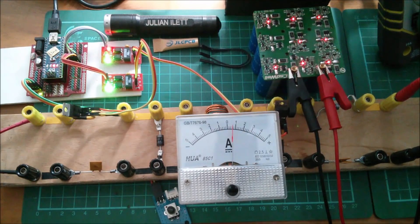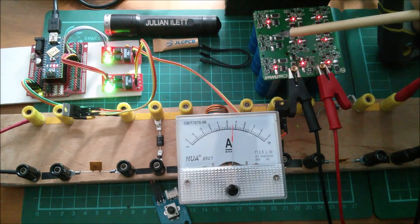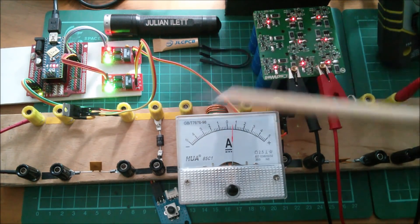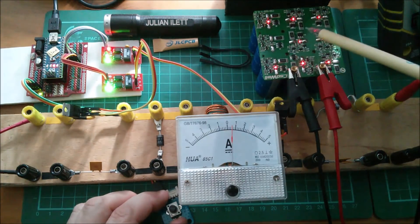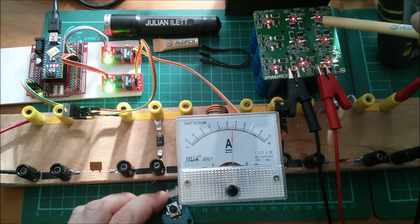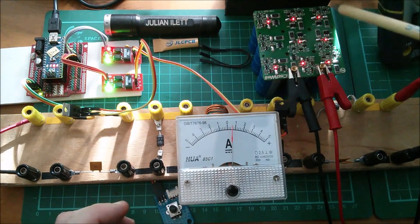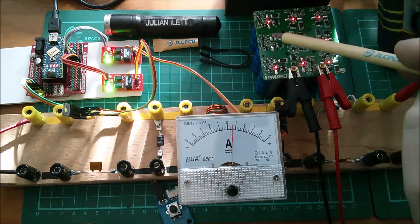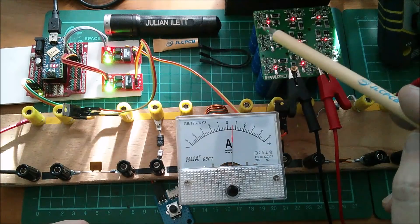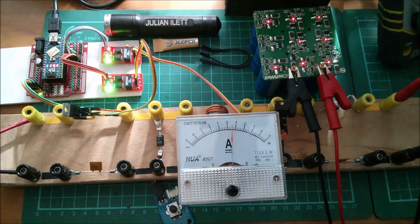So I remember what I wanted to do now - I wanted to soak charge the capacitor that's low. What I'm going to do is solder a couple of wires directly onto the capacitor points there and then just charge this capacitor on its own with a buck converter, not with Muppet 2, because current control on this is a little bit twitchy. I don't have to move the pot much and I'm sort of going between half amp and one amp. The problem is these resistors are very close to the capacitor connections and as they get warm, sitting there burning energy, they're warming the capacitors up - I didn't want to leave it for any length of time doing that. So I think the only way is to solder connections directly to it and use the little buck converter to lift this one up and balance it with all the others.